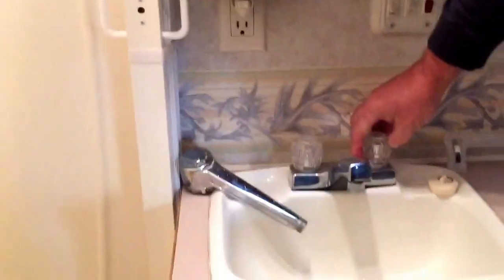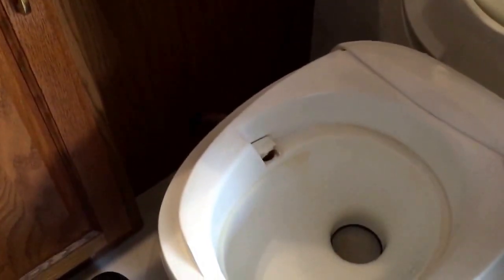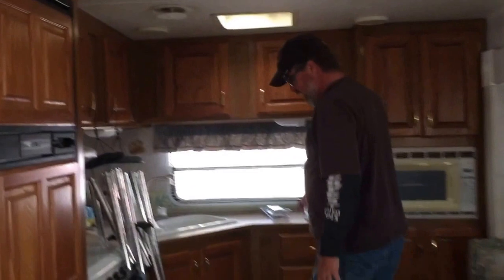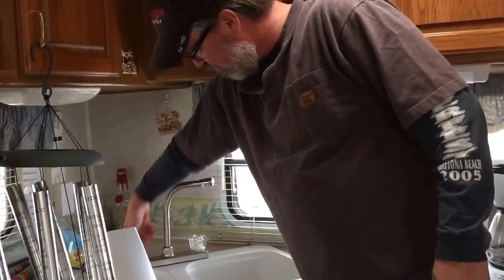Alright, now I've done this about three or four times. If you can see, there's still water coming out but there's a lot of air. When I put my hand in front of this and don't get it wet, all my water is out of the lines. It takes several times, but as far as I'm concerned, it is well worth it. The hot water heater holds a lot of air, so once you fill everything up, it takes a while to get the air back out of the line. A couple more times and we'll have it done.